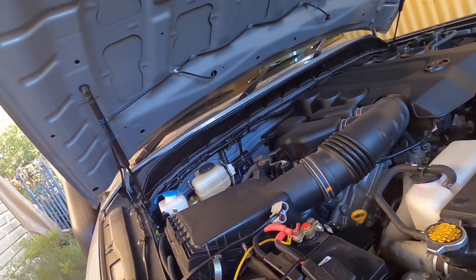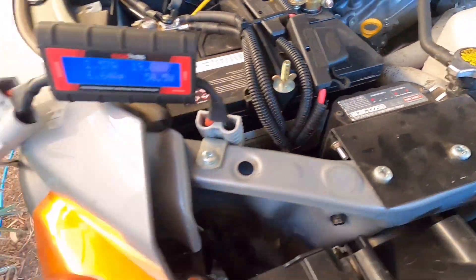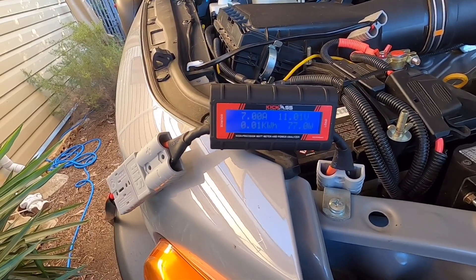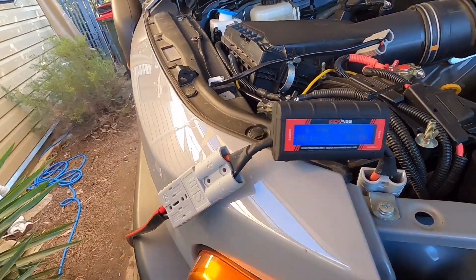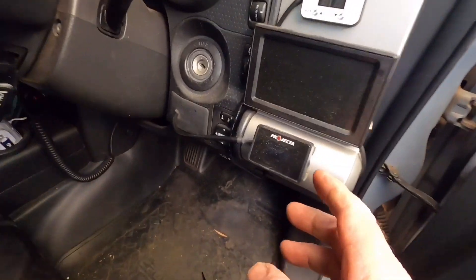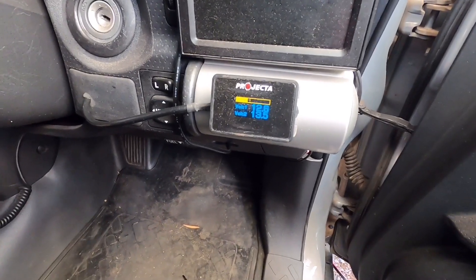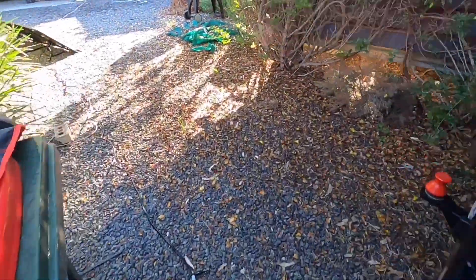It's been about half an hour since I plugged this in - it's now quarter to eight. The lights are all up and charging. I just looked at it a second ago and it was putting in 117 watts, about 15 volts and 7 amps - it's adjusting a little bit with the sun. The battery is now sitting back up on 13.4 volts, which means it's sitting on a float charge. Technically that battery is pretty well charged back up again from the night before, all within half an hour.